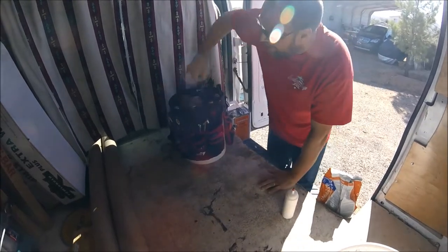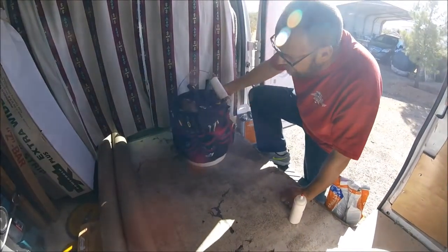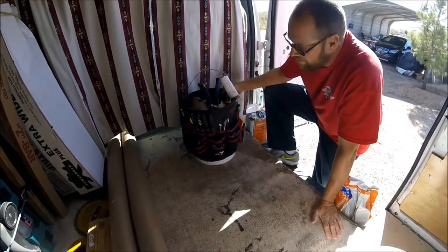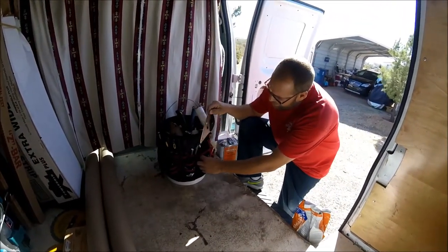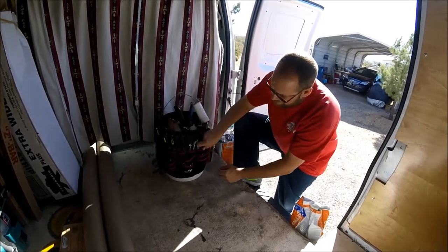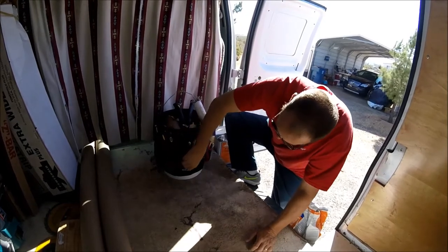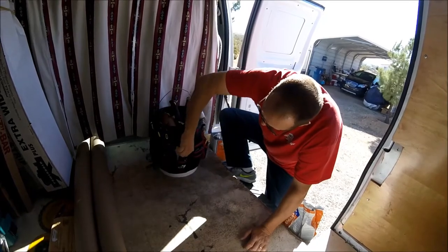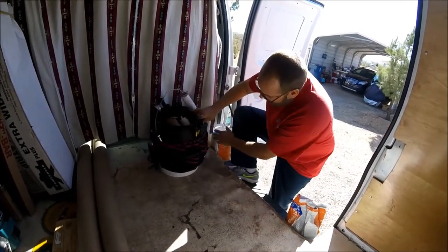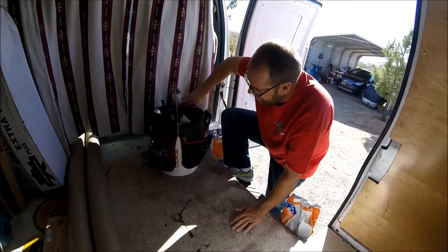As I work my way around, I've got this a little bit organized too. I try to keep all my stuff in the same spots all the time so I don't have to go digging through stuff. Right here, when it comes to seaming, I've got my seam cutter, my row cutter and my napping shears - those are the two cutters. This pocket is all different sorts of row cutters, so whichever one I need I know right where it is. And then my next pocket is my seam roller. All my seaming stuff is right here in one section.